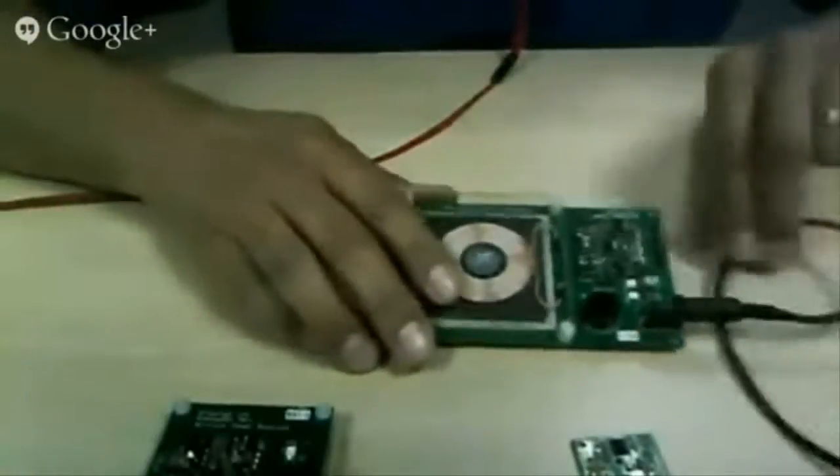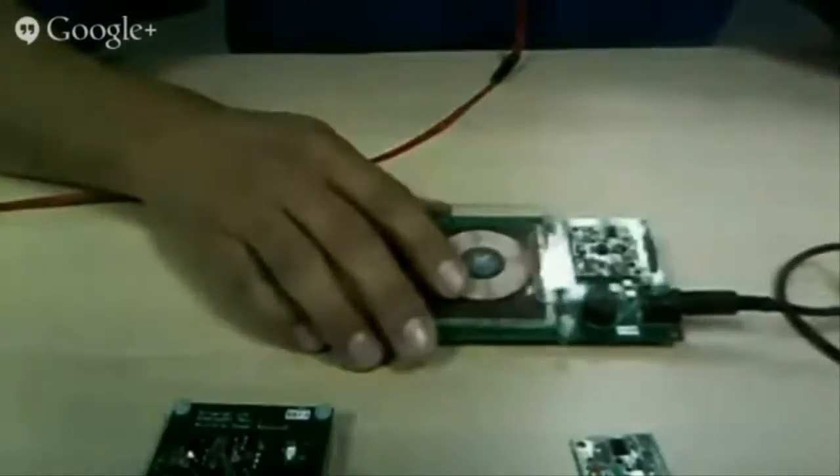Qi is a standard, and in that standard it specifies a number of receivers — either 5V or 19V — and we have two transmitters, a 311 and a 312. This particular transmitter evaluation board is a 311, which is 19V, so I can use my laptop supply to power it.